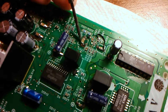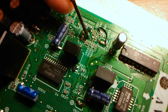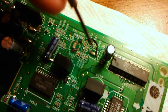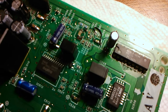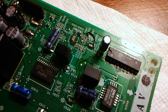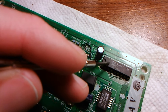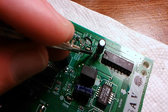This 22 microfarad capacitor had leaked all over this area, which is why you see this extra capacitor lead coming through here repairing these connections to the board. This wire I didn't know I needed to replace until after the job — after I was done with the cap change and testing, the audio for the HuCards worked great and the CD audio worked great, but the audio for the ADPCM audio chip was not coming out. That was because of this bad connection, which is why you see this little wire bridge to the ground on that capacitor.